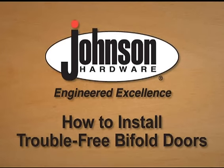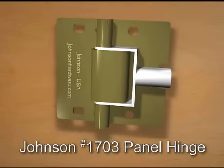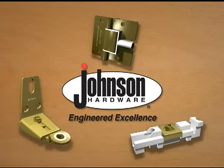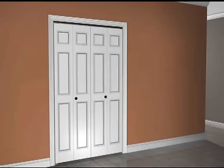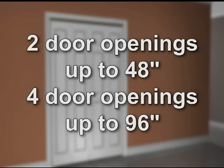Johnson's 1700 bifold door hardware provides innovative features, such as a positive pivot lock, unique breathing hinges, and adjustable jamb mounting bracket. So do-it-yourselfers and professionals alike can avoid doors that clatter, stick, or refuse to stay in place. The easy-to-install 1700 hardware accommodates door panels from 3/4 inch to 1 3/4 inches thick, weighing up to 40 pounds each. Sets are available for 2 door openings up to 48 inches and 4 door openings up to 96 inches.